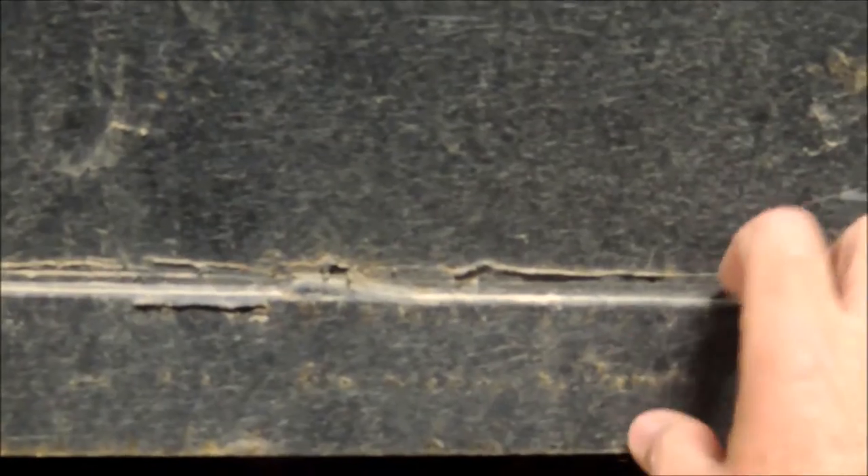This trailer would normally not have this band. When we're talking about trailers that are rolled steel, this piece runs all the way down here and underneath. That's the way this trailer was built. What they've done is they've come and added on — you can see the little tack welds here — instead of being continuously welded, it's just tack welded and repaired. And they've put a two by, probably two by four angle.